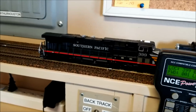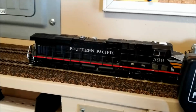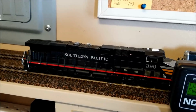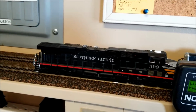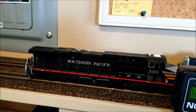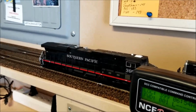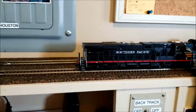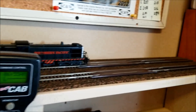Okay, so you want to know about the engine. It's a Tower 55 engine, okay? They don't make them no more. Tower 55 was bought up by somebody else. These engines all had worm gear issues. Northwest Shortline has made replacement gears for this. You have to take the one off the end of the shaft and replace it because they all split and cracked. So that's the story on the engine, okay? It's an antique collector's item. But anyway, this is the project.